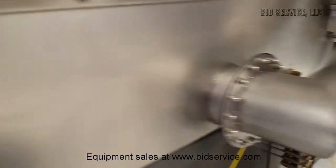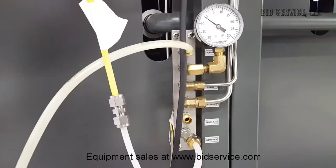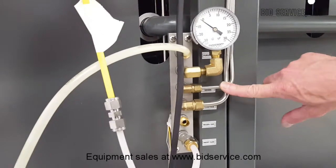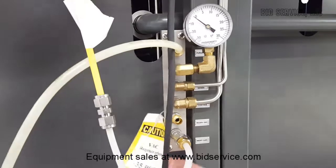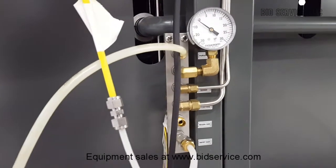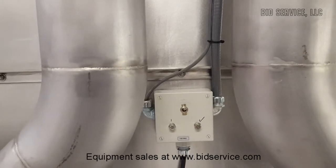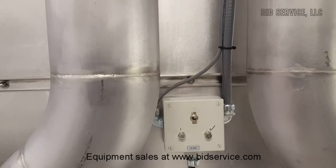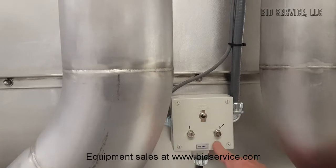Coming up to the back here, this is where you bring in your gas line, and there are labels. We have a purge vent here, there's a pressure gauge here that monitors the pressure to the box, and we have a pressure control line. You hook up your regeneration gas here — the recommendation on that is 35 psi. Our inert gas — right now we're using nitrogen. Just up slightly here you'll see the control for our blowers. There are two blowers, and the on/off is here. You can control the speed of the left and right side using these pots here.